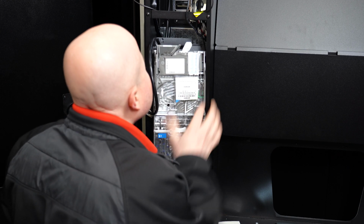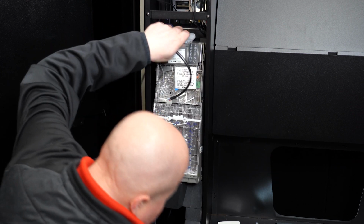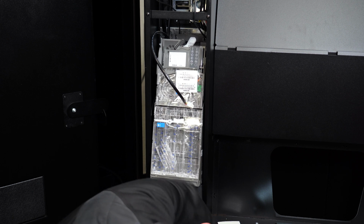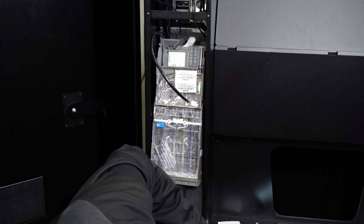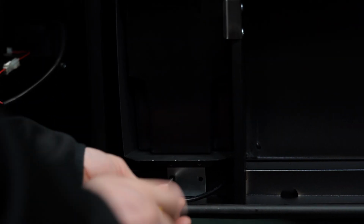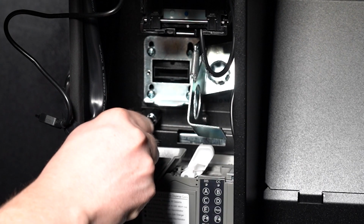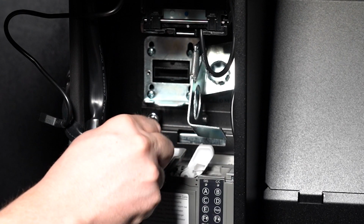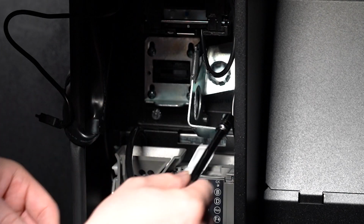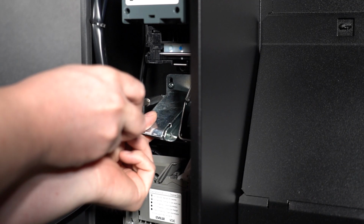Next, reinstall the coin assembly. Make sure the harness is free and not cut off by anything so it is not damaged. It is best to loop it through the bracket on the top of your coin mechanism. You can then tighten down the nuts near the coin box at the bottom and back underneath where you will place the coin chute. Secure the coin chute back in place.